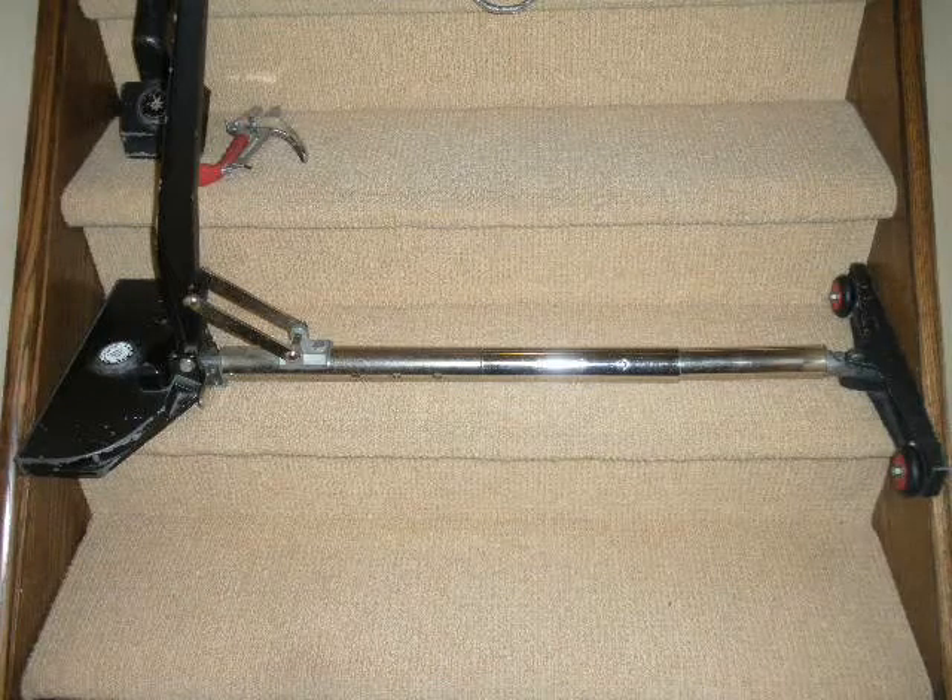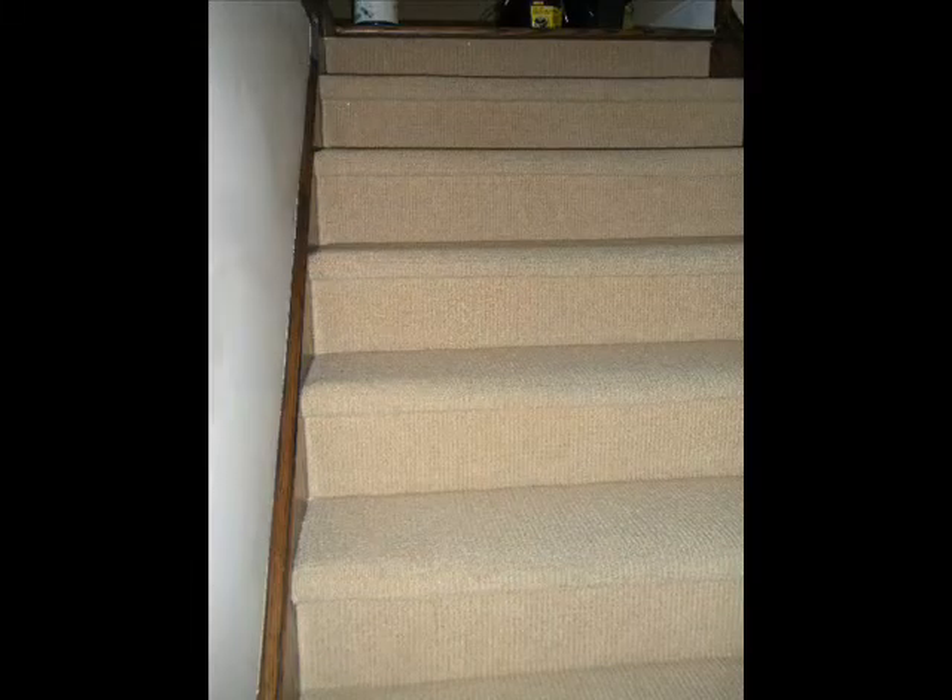It works well, but it's really hard to use a kicker to pull these out. A lot of times I'll use my power stretcher because you can get more torque out of it, and it's hard to kick sideways in a short area like that. So if you've got a power stretcher, I suggest using that.